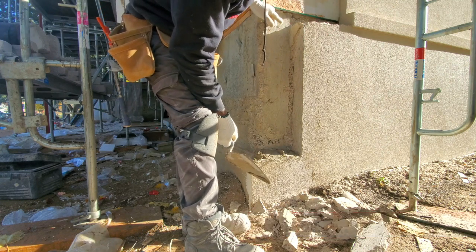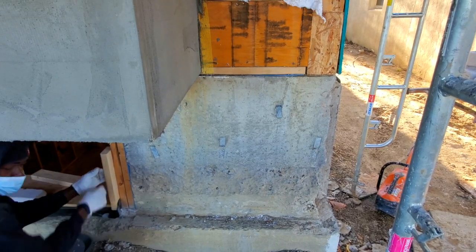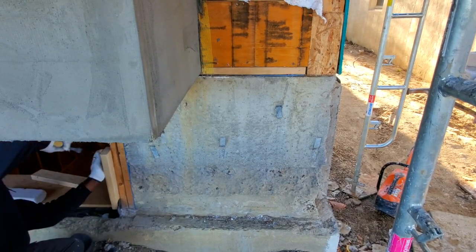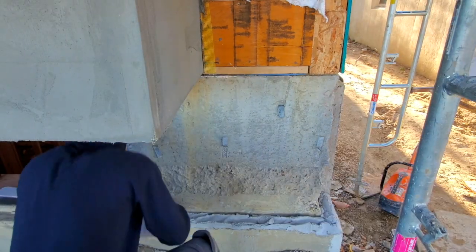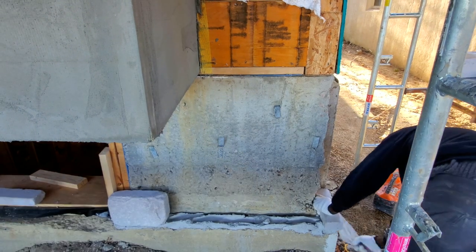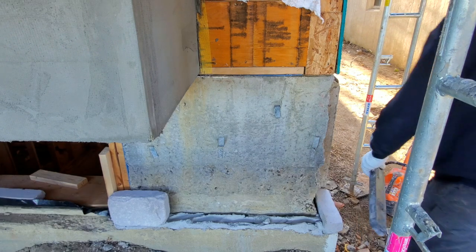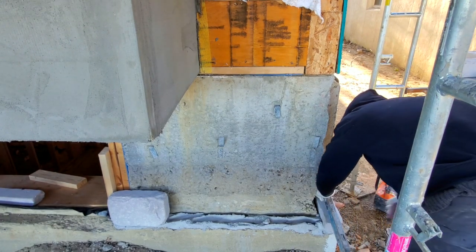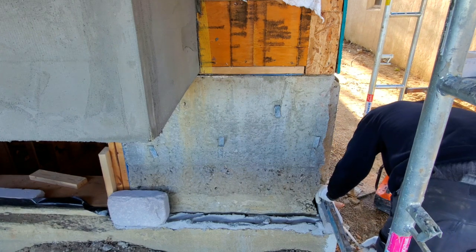For our weeping plastic, we're going to go around six inches down from the bottom of our plate. Next step: you want to put a piece of lumber right onto your window, just because your window is not in yet, so you can use that as a template to buck your stone right onto it. That way, when you remove it, your stone will be a quarter inch away from your window.